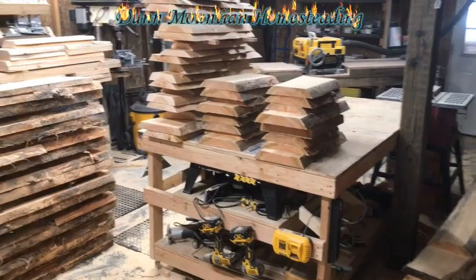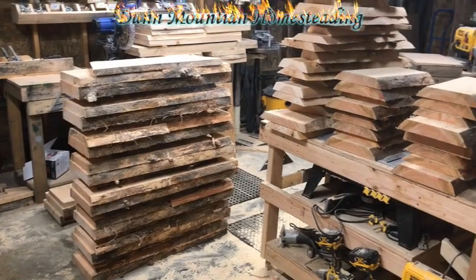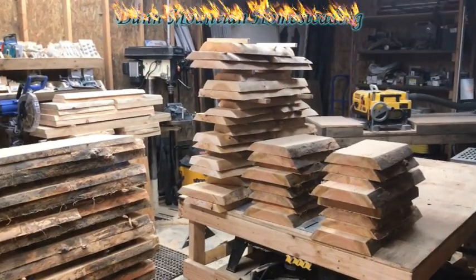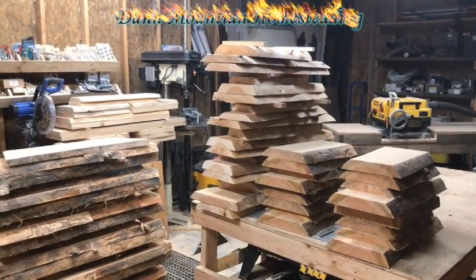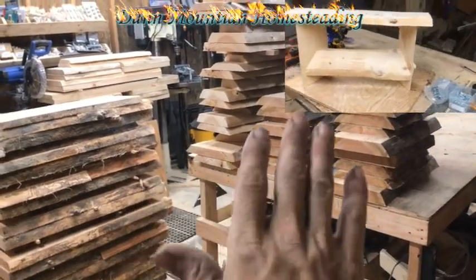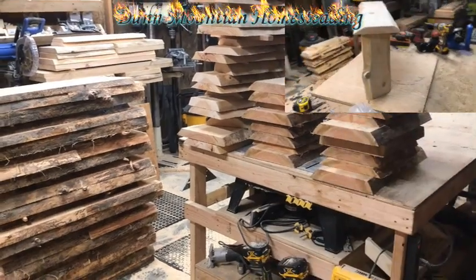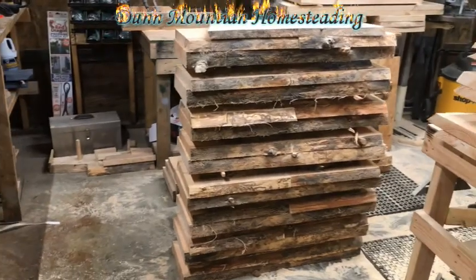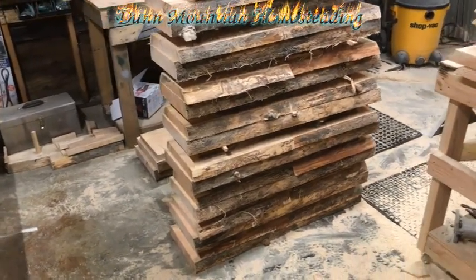Check this out. All right. So I got some wood to plane. I've got it all cut up. I've got 2-foot benches, 18-inch benches. I got these 32-inch benches that are going to be about, I think I did 18 tall, but I'm angling the legs outward to give it some rigidity. And then I'm putting a board underneath at an angle, which gives you a foot support, plus it helps with the rigidity of it. Over here, I've got my 8 benches for my 4 table and bench setup.